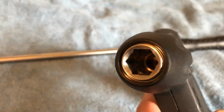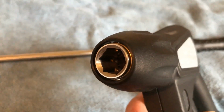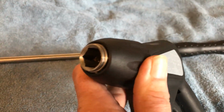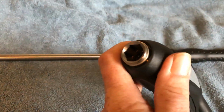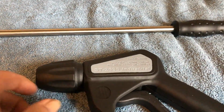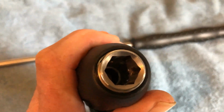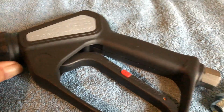If we look inside here, this is classed as a quick release spigot gun, also known as the Q gun. What simply happens is you pull back and push your quick release into that point there. Same again on that part, there is a seal inside there as well that can easily be changed. You'll see the Allen key there, you simply get hold of it and unscrew it at that point and just put the new seal in, if you ever needed to, inside the actual spigot itself.